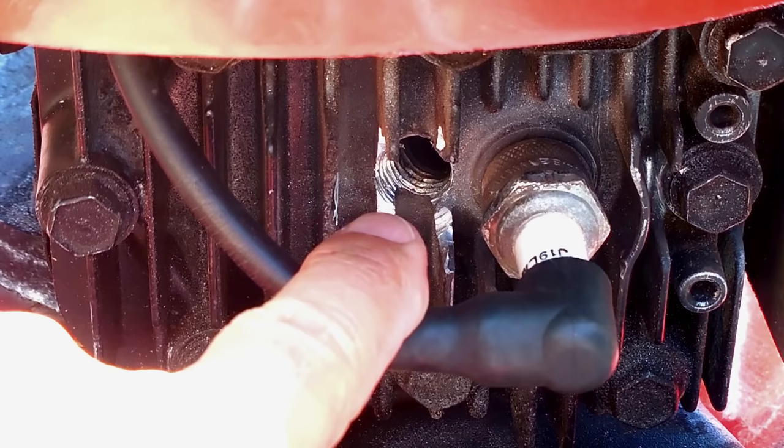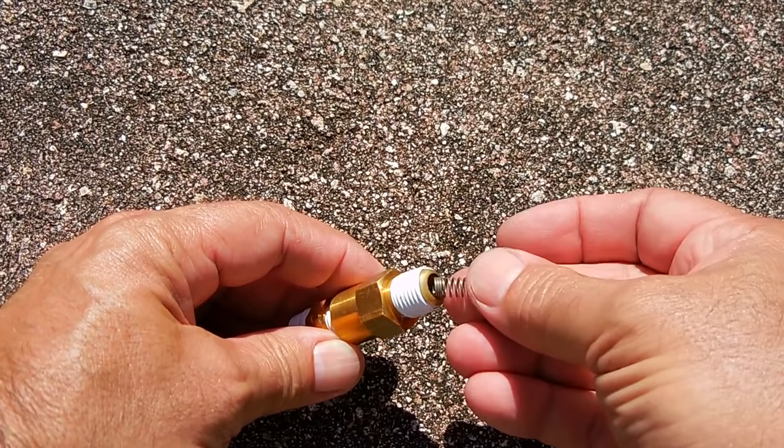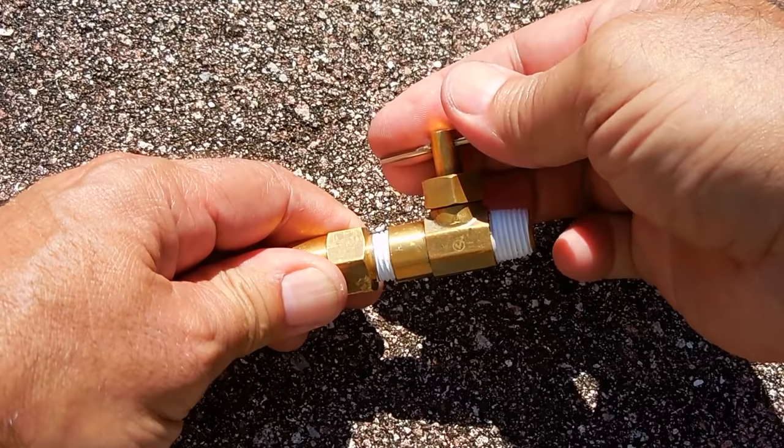The head had to be removed and reinstalled. Right here you see two fittings connected together — the one on the left is a quarter-inch hex nipple, and it's threaded into a quarter-inch check valve. You can see inside there's a spring and steel ball. When I got this it had a piece of plastic in the end that had to be removed, so I installed a longer spring so when the valve is threaded onto the end it pushes on the spring which pushes on the ball. The purpose of this valve is to regulate how much pressure is leaving the combustion chamber.